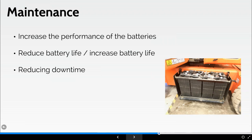If I take a battery that I'm looking at now, I don't just wade straight in there. I'm going to look at the battery, obviously donning my PPE as appropriate to risk assessment, but I'm going to look for anything like cracks, any chips, any deformation anywhere. Perhaps even bulging of the battery would give you an indication. I also need to be mindful of what I'm carrying around my person. Things like watches, rings, jewelry, chains.